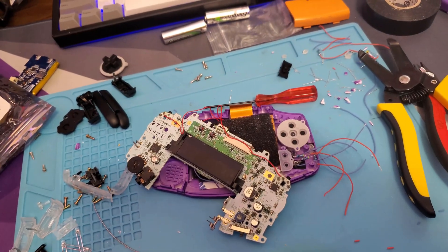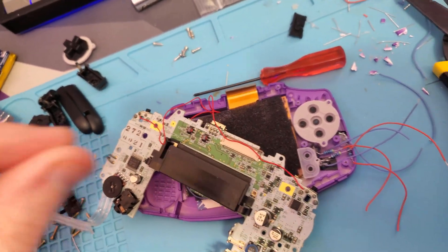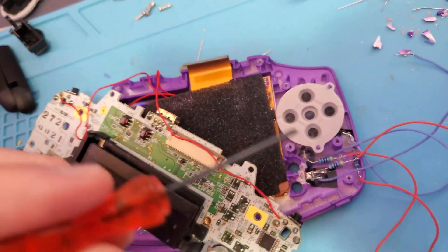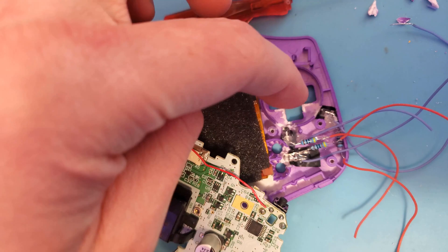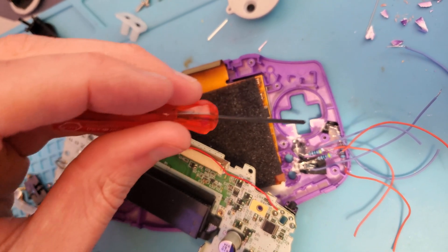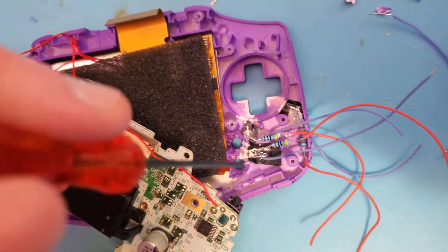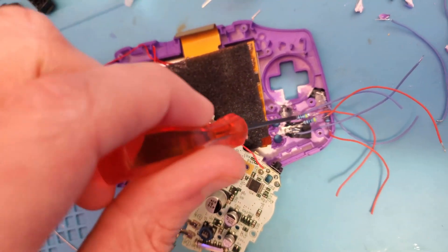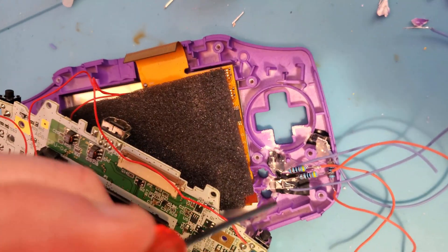This is one of the most messy mods I've done — there's just not a whole lot of space to work with in here. I have an LED here pointing in, and I cut out that little section right here, and I cut it out on that side too. Over here I went ahead and cut out that whole little section on the start and select area. I haven't tested that yet. There's some electrical tape under there because it was shining through the shell.